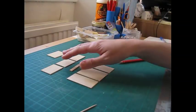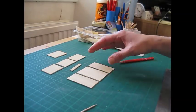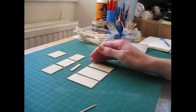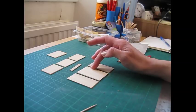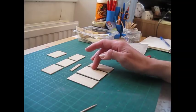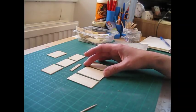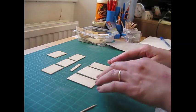Begin by cutting all of the pieces apart from the bits you need for the drawer. I always advise constructing the main body of the unit first and then measuring and cutting for the drawer, because if you slightly misplace the shelf piece — which is the bottom of the drawer shelf — then the drawer sizes will be different. The measurements in the cutting list are just a guide, so always construct, measure, and then cut your drawer pieces for a much better fit.